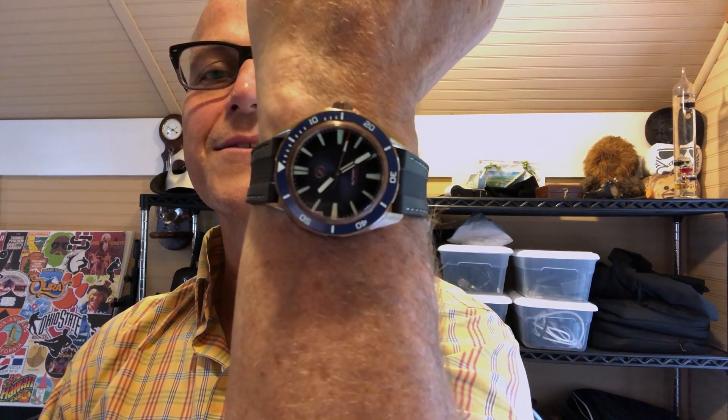This is quite different than a quartz watch — I really don't think you could call a quartz watch an escapement. What it has is a counter, so it's kind of a similar thing. In a mechanical watch, there's a spring that rotates back and forth — let's say five times a second — going click, click, click, click, and every five of those the second hand moves one second. Then there are gears so that 1/60th of that is for minutes, and 1/60th of that is for hours — that's how all the hands move.